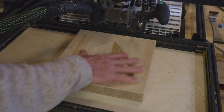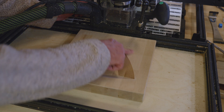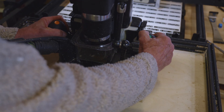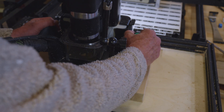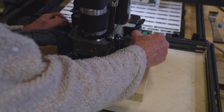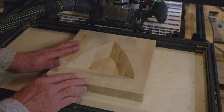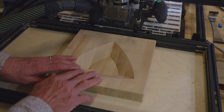Here's the inside of that bowl — pretty big size pocket. To be honest, I don't know if I really needed the Z sled to cut that pocket. Without Z sled it's a little bit unstable — kind of on a corner — but I think it probably would have been okay on BenchPilot without the Z sled. Still a decent demonstration: if the bowl had been an inch or two bigger in either direction, the base of the Shaper Origin would have just fallen into that hole, and that's exactly what the Z sled is meant to avoid.